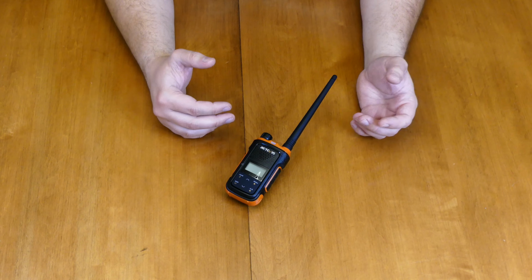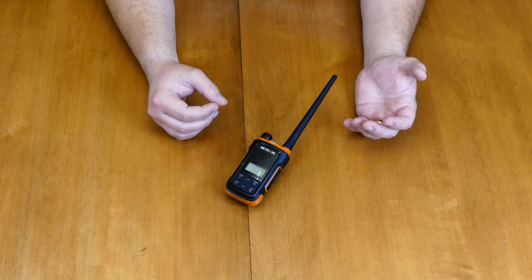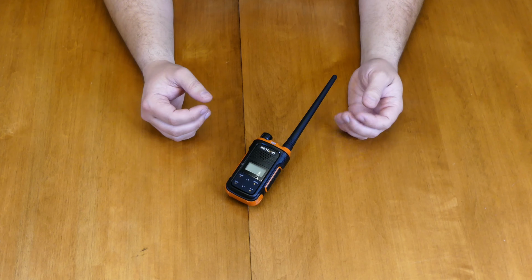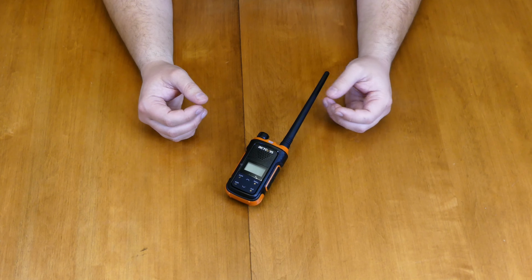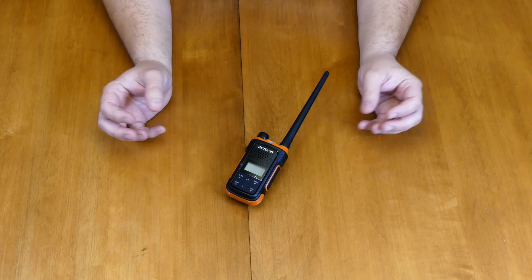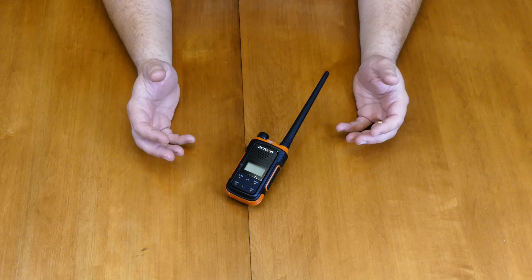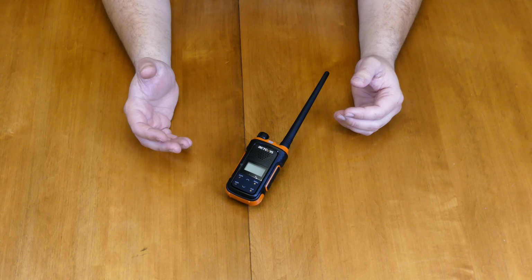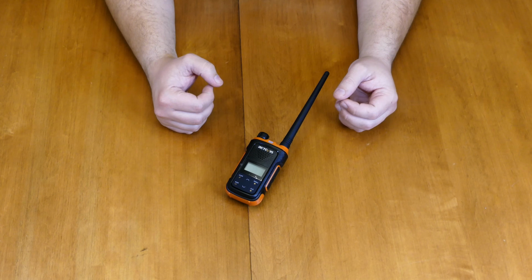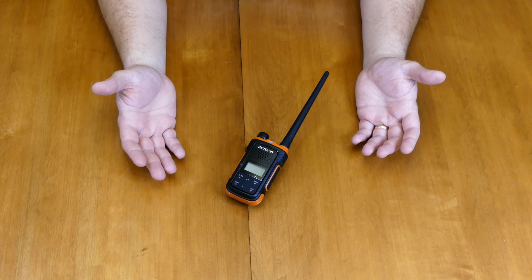When you talk about radio communication, a lot of people first think something like a CB radio, or something like the little walkie-talkies you buy from the blister packs, also known as FRS. There's a few others out there that are less common. There's also a few that are growing in popularity. The difference between all of those and this one is it's kind of this nice sweet spot of capability, cost, and license requirements. So if you get something like GMRS or amateur radio, you need a license for that. If you get something like FRS or family radio or MURS, you don't need a license.